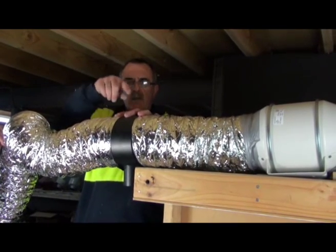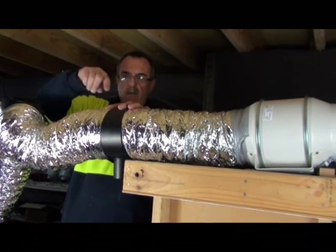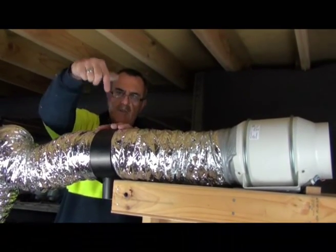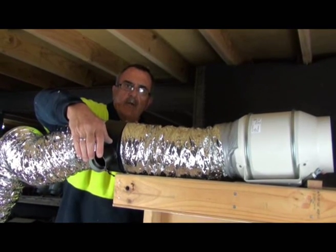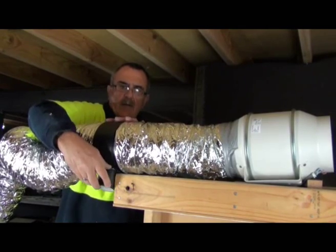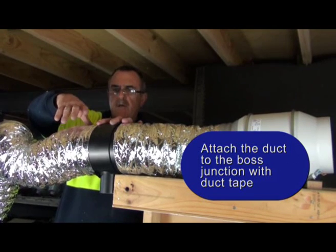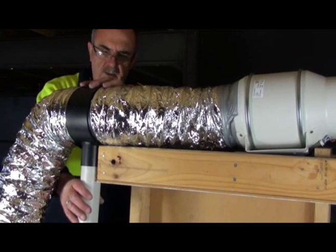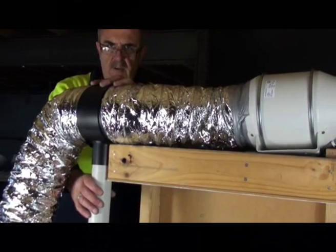After you have cut the duct, you need to put your boss junction, which is part of the OVK2 kit, into the area where the cavity is for the wall down to your toilet. If you can't go straight down, you can always move that to the side and put a 90 degree bend on it and insert it through the closest area. Then you just need to reattach the other length, the other side of the flexible duct which you've already cut. Once the boss junction is in place, you need to feed the 50mm pipe up through the wall cavity into the bottom of the boss junction.